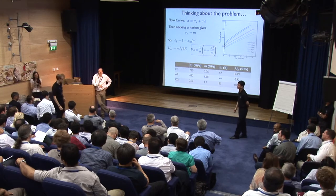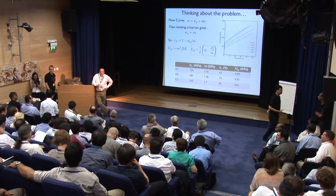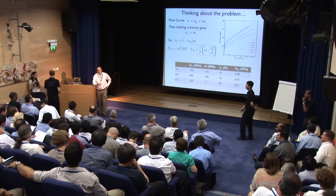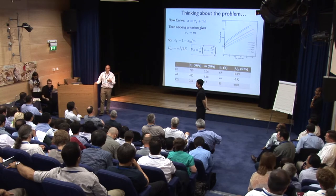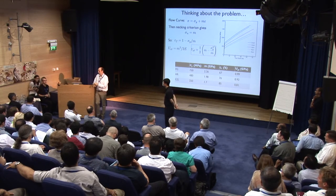My third question is, when you measure the grain size, do you consider annealing twins? No, we don't, so we ignore them. You could have a debate, but the number density of them is not very large. I don't think it would make a large difference.